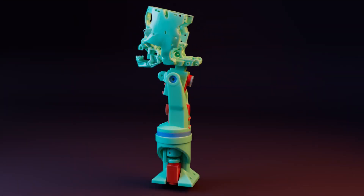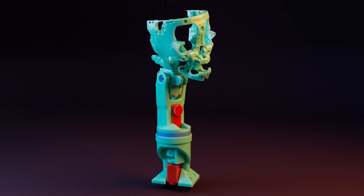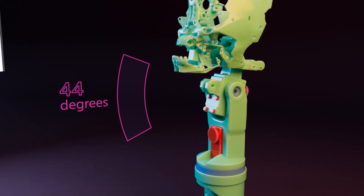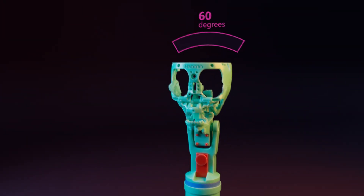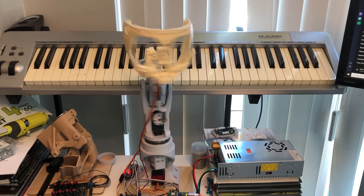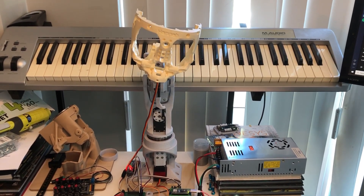I've made a new neck design here, tried to focus on something a bit simpler. It's only got three axes, three motors, fewer parts, easier to assemble. I was aiming for something that would be a little bit more robust, but there ends up being a whole lot of backlash in this that I still have to work out. I think that can be done with a few redesigns.